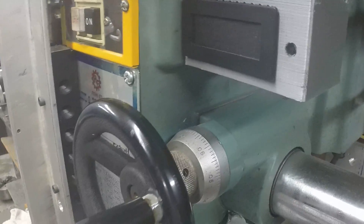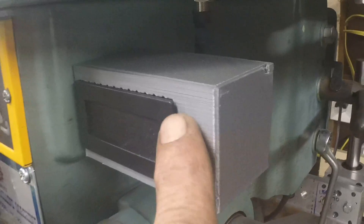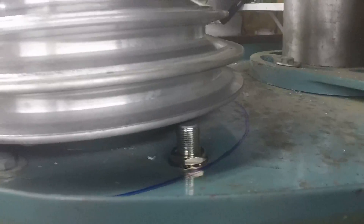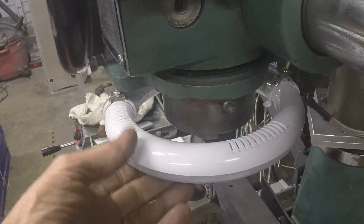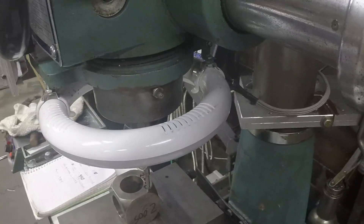I'm going to point out some mods I made on my milling machine. I added the tach with the reader up on the pulley — there's a little magnetic thing up there. I also put in this 8-inch light around the quill. It goes up and down with the quill, so you can really see now.